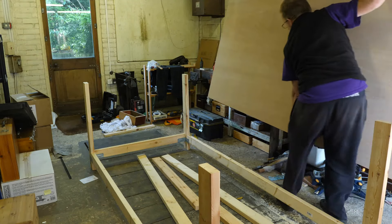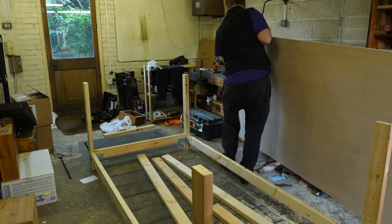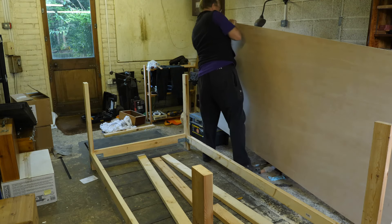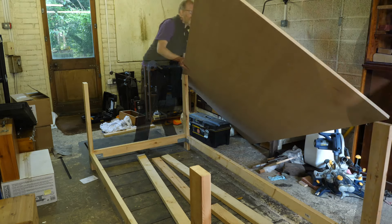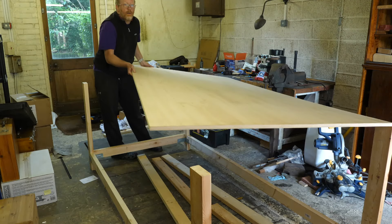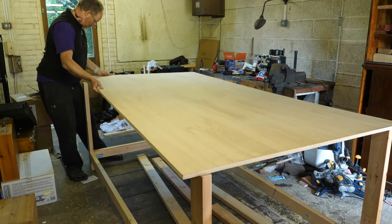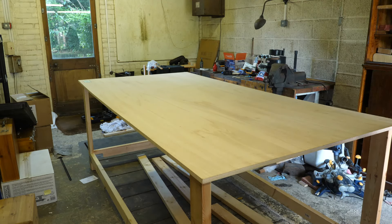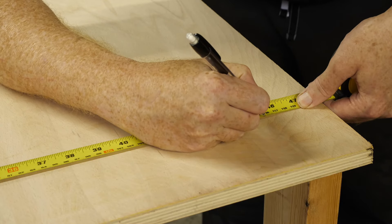Before I fit the top corners and struts, I need to get the lower shelf into place, as it'll be much more difficult when the frame is fully assembled. The only indoor space I have big enough to cut this to size is the top of the new bench, but getting the plywood into place on my own took a bit of careful balancing. The shelf needs to be trimmed to size, as it doesn't need to stick out the way I want the bench top to, so I mark out a 64mm strip to be removed.